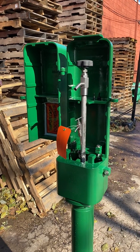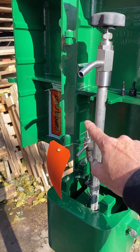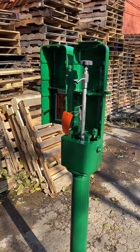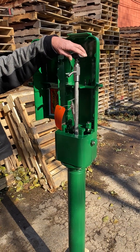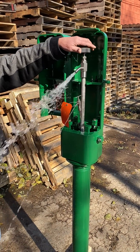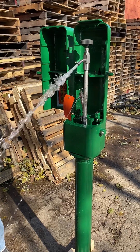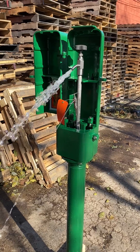What we want people to do now is to open this petcock all the way and then go ahead and open the sampling station and get both pipes flowing. Let that run till you get your chlorine residual — this is now warming up both of those pipes — and then you want to shut it down.